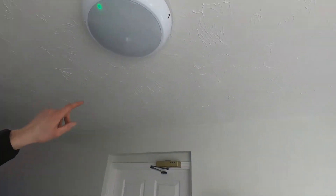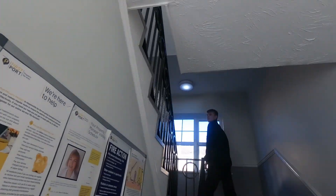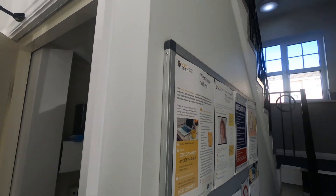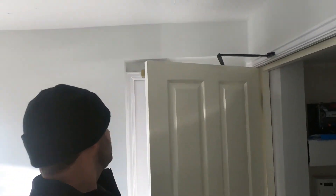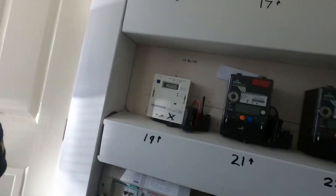Also while we're here, we always test these emergency lights - got them all up the stairs there, so we'll just do a quick flick test. Just literally isolate the power like that. Jack will run up the stairs now and just check that they all work. Check they're all powered on. Once we're happy with that, we'll just power them back up. Jack's been up, checked they're all on. There's one slightly dim that's not an LED fitting, but it's okay, so now we're just going to power back up and that's that done. Just got another seven blocks, we'll just whip around and check them while we're here, then we'll be moving on to the next job.